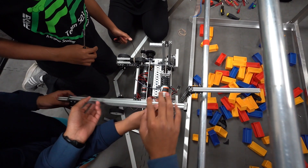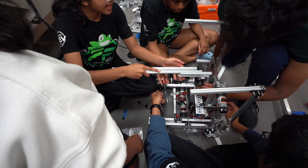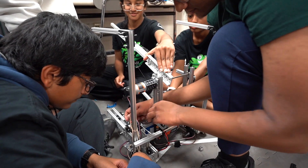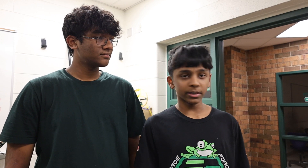The frogs have discovered a few problems. The hooks are on the wrong way — we have to flip them in order to reach and put back the stopper on the side we're climbing from. Basically, we're going to climb from the back. Another problem is on the linear slides: the pulleys are having a hard time getting on and staying fully attached. We also have to move the spool for the climbing hooks since we're repositioning everything.